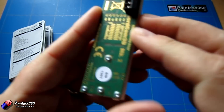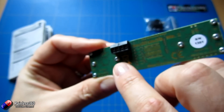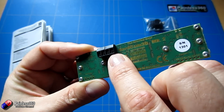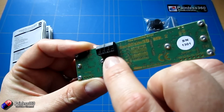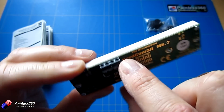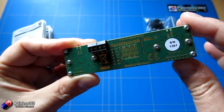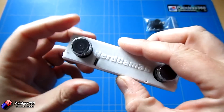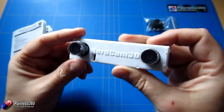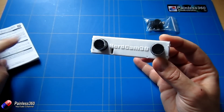The only connections at the back are four: ground and the 3D image video out, and ground and five volts in. It's recommended to have a separate ground for each, but you can use the little connector blocks to plug in cables from your video transmitter — five volts, ground, and video. Apart from that, the dip switches at the front let you select the operating mode and a couple of other settings, all covered in the manual.